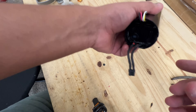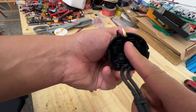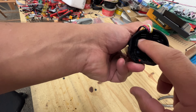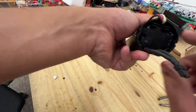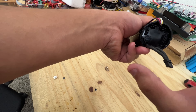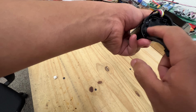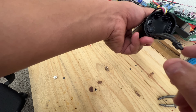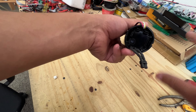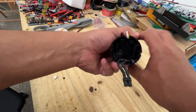So in order to wake them up, what we have been doing is drilling a little hole somewhere around here. There's a reset button, so all we do is click on that reset button and then the light starts blinking again. While that's happening, you can charge the battery and then the BMS will stay on. If you click the button right now, it most likely is just going to turn itself back off because the state of charge is still low.